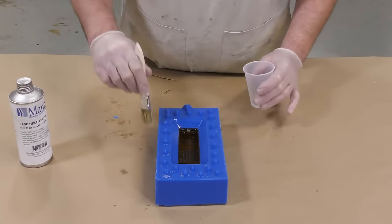Two hours later — I gave this material some extra time because it's quite thin in certain sections, so I wanted to make sure it's absolutely fully cured. Once we remove the mold from the pot, we can demold the top half. Any of the extra material simply peels away since it's very thin at those edges, and with a little scraping using an Xacto knife it's fully cleaned and ready to be installed.